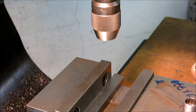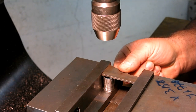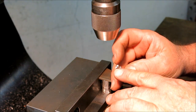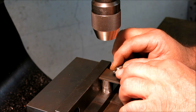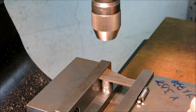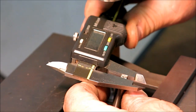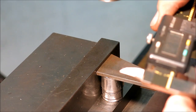So what we're going to do is we've got a little piece of steel here and I'm just going to back it up with something right underneath where we're broaching to stiffen it up — because I don't want to cut the steel, I just grabbed a piece out of the junk bin. I'm going to measure across the flats here and get a drill that's just a teeny bit bigger than the distance across the flats. What the broach is really doing is it's just taking out the corner material. I measured this and I get 0.1795 to 0.1800. This drill is a 0.183 to 0.184.